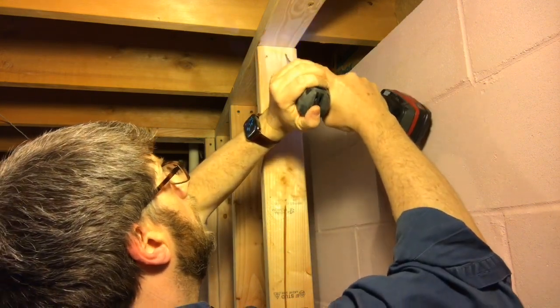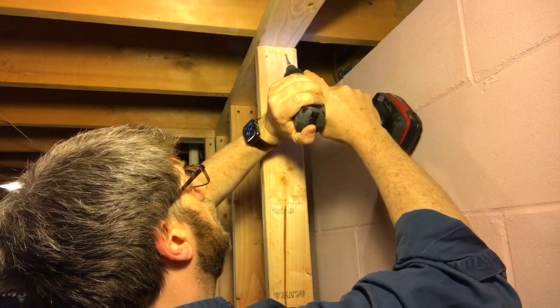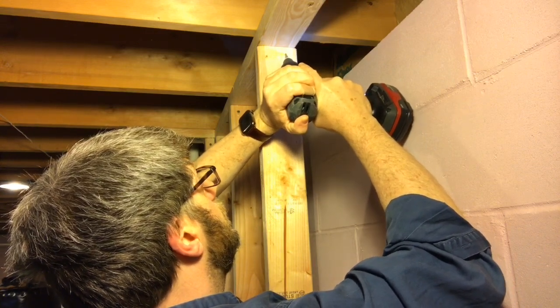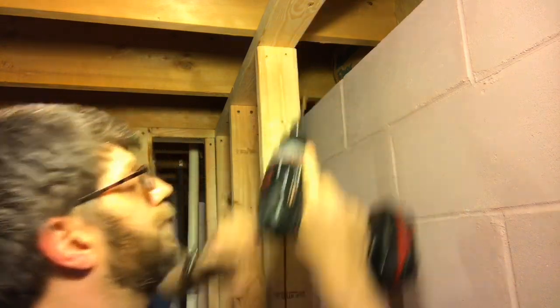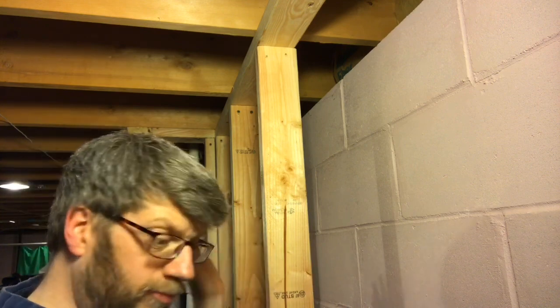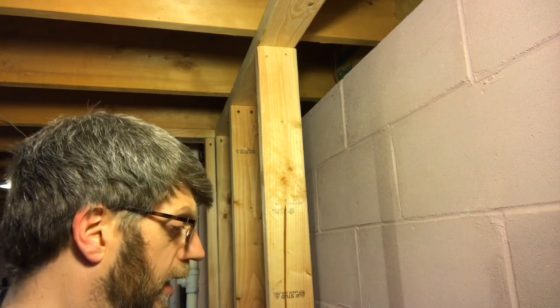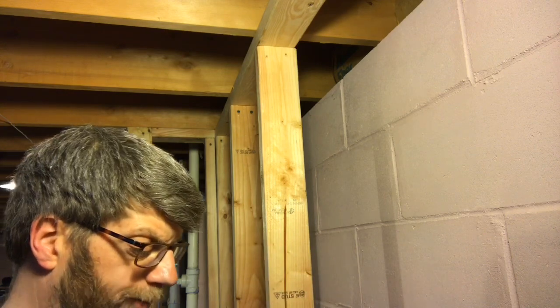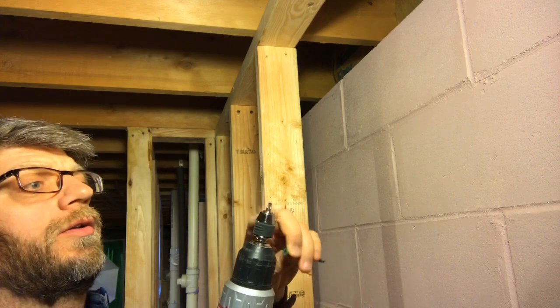Here's my electric drill with a drill bit. I'm going to put it right against the stud, about an inch down, and drill just a small indent. I'll do a second one about an inch in and an inch down. The reason I do this is that when trying to drive a drill bit diagonally on a piece of wood it tends to bobble and jump around. By making a small indent first, the bit stays in place when I position it. Then I drill at about a 45-degree angle, trying to get the bit through the stud and into the top plate as well.